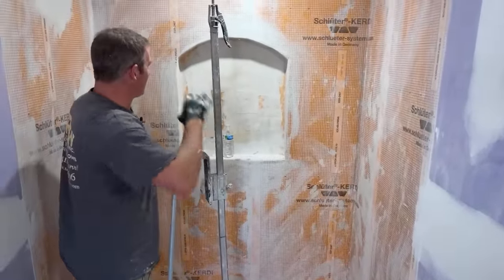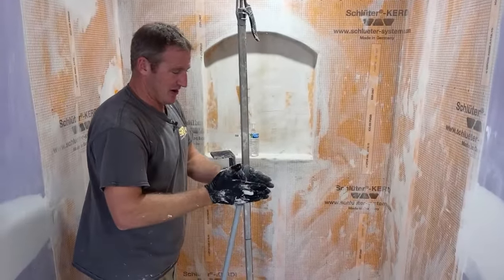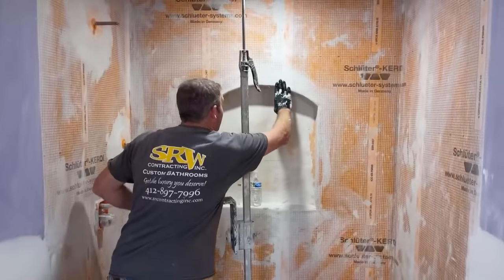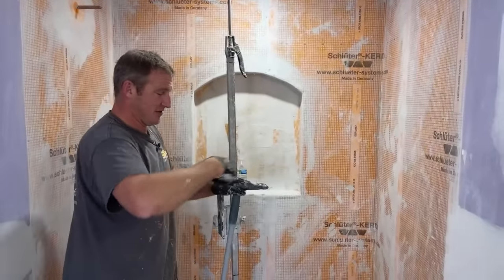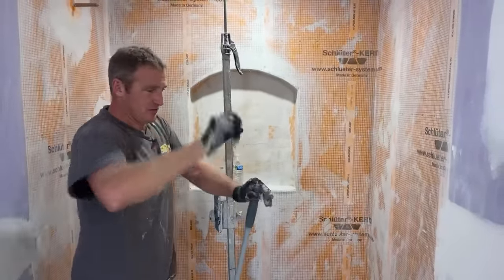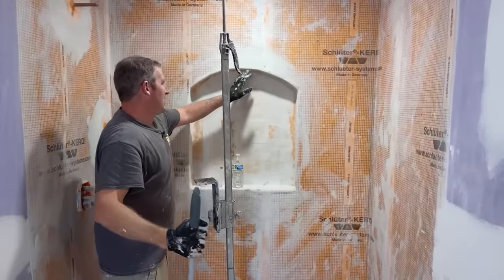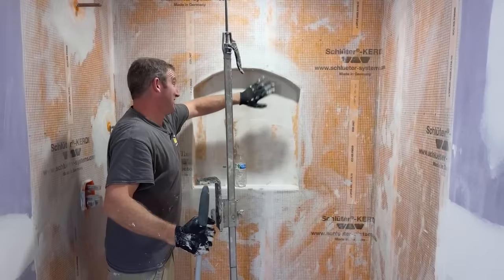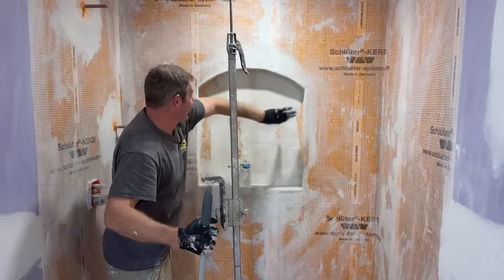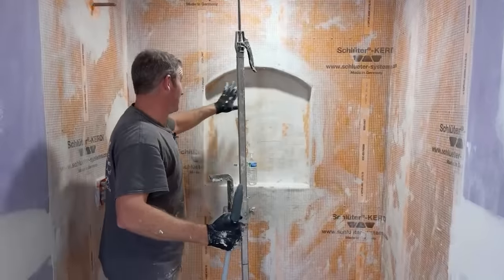You still have to cut, basically, to do that archway. I always use a speed square on the back of the piece. So if you cut a 3.5 inch deep piece and you just make score marks every half inch all the way down, and then you snap it, it allows it to create that curve. If you did Wedi, I would definitely purchase another tube of sealant to smooth that whole thing out. But no doubt, that would have been easier to install.